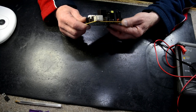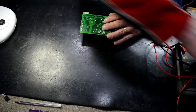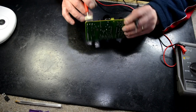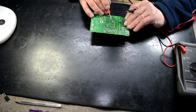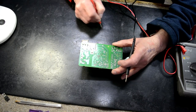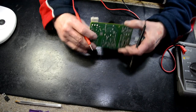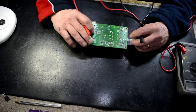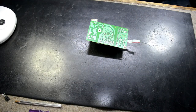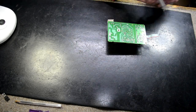Looking at the direction of its output, if that's going to ground, and it is. So with our capacitor here, it's got a line on it, so that's ground, that's positive, that is earth, and that is our diode. So our diode is actually going from earth to that point. So that diode would have to be a Zener diode, if that is the way Zener diodes are configured.